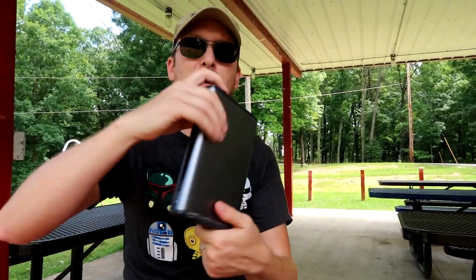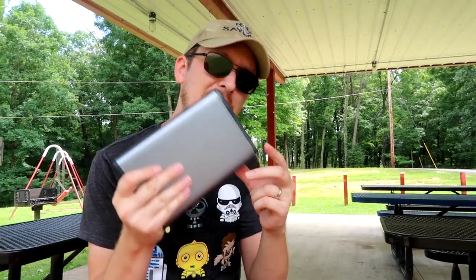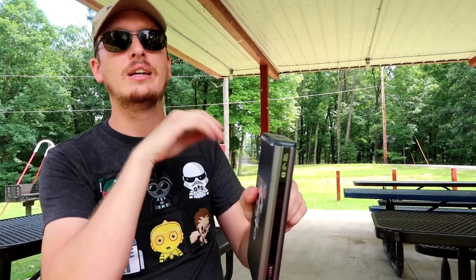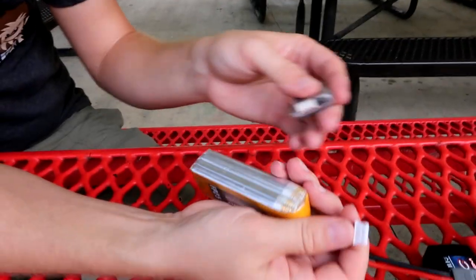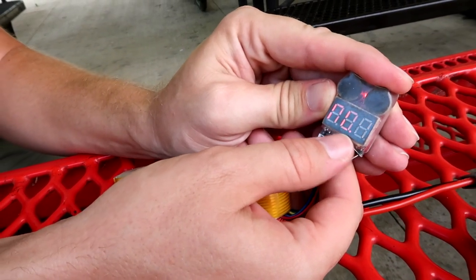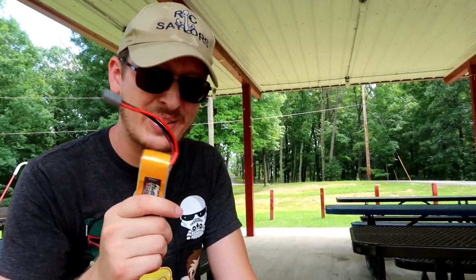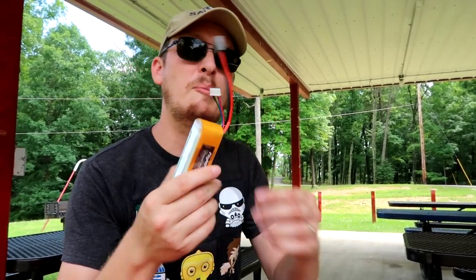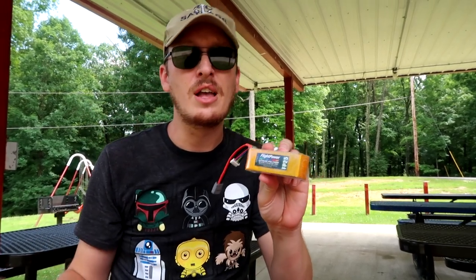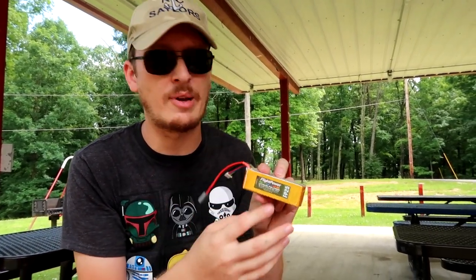This battery is Abby's big phone-charging battery — I dropped it and it just killed it. Because it's such a big battery, all battery in a shell, we're going to show you how to safely get rid of it. This is a four-cell lipo — it's telling us cell one is at 1.63 volts while the rest are higher. 1.63 volts is dangerously low compared to the others, and this is exactly the case where guys might try to juice up all the cells on a nickel metal hydride charge. Not worth keeping around.